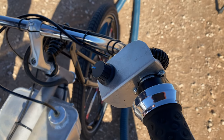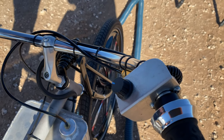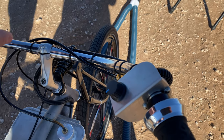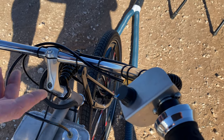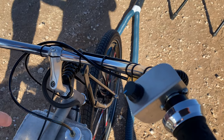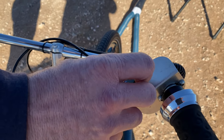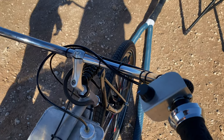It's interesting though, it doesn't run like a regular internal combustion engine. Increasing the throttle doesn't increase the RPM or the rate of combustion. That stays pretty much the same at around 100 hertz. But you're increasing the amplitude by adding fuel to it.